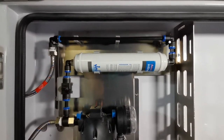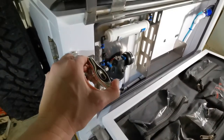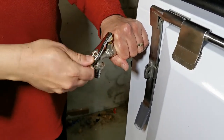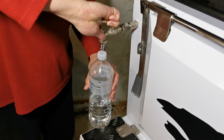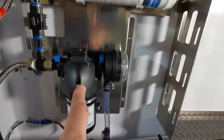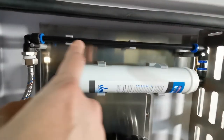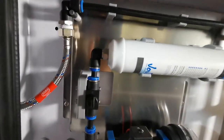Here's an overview of the panel in position with the piping laid out. We included two outlets from the system. One is a tap for drinking water, using a surface-mount quick connect system so the tap can easily be plugged in or clipped out when not in use — it's a swivel tap that opens and closes. For drinking water, the water comes up from the tank through the particle filter to the pump, then up through a diverter which allows it to go through the disruptor filter to remove further impurities, and then connects back to the tap on the outside.